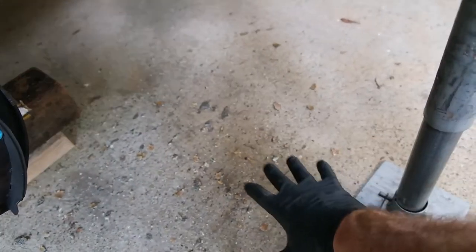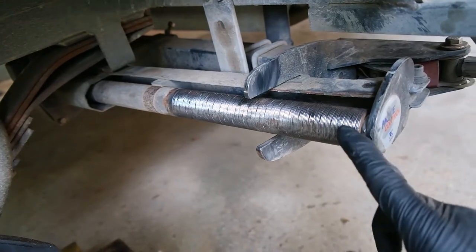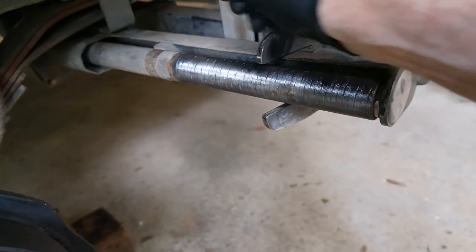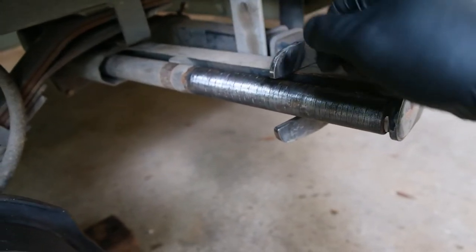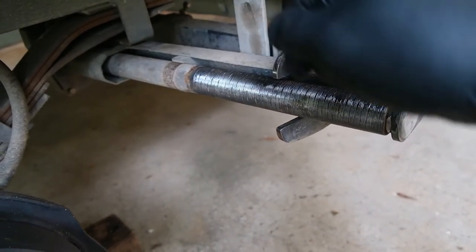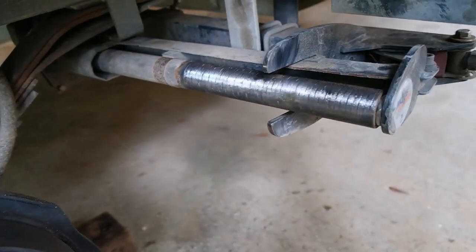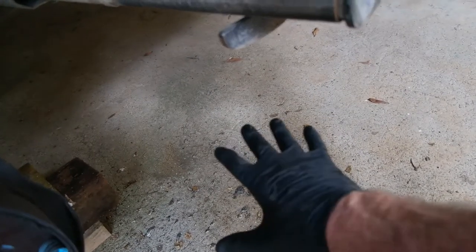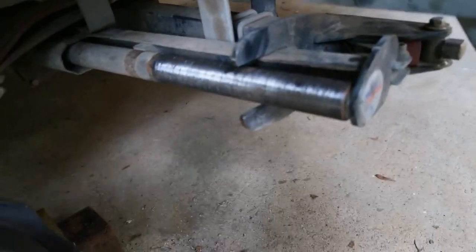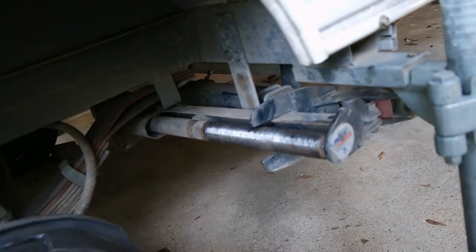Got to put something on the ground here because after you put the resin on the roller, the next job is to come along here and sprinkle, you know, just with a teaspoon, and you sort of, you know, will sprinkle it by hand till you get a consistent coating, then roll the roller a little bit and do it again. So until you've completely coated it, then all the grit that falls down, you've captured that on some newspaper or something, and you can reuse it. So you really don't use a lot of grit at the end of the day. Anyway, I'll get on with it.